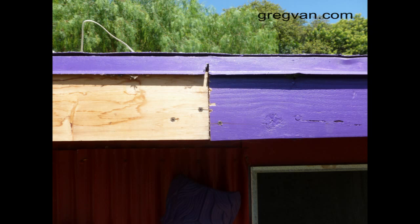You're not going to do this in 15 minutes without cutting the metal most of the time. You could either put another piece of metal on if you wanted to — the roofing isn't bonding to the metal very well — and then re-bond the metal to the roofing material with some type of roofing sealant. All you need to do here is fill the gap between the new and the old fascia board with some type of caulking, and then just fill the gap where you cut the metal with caulking too.